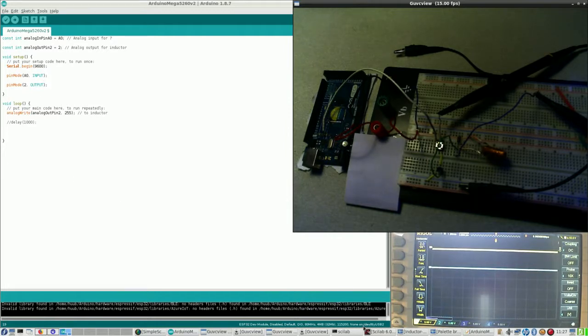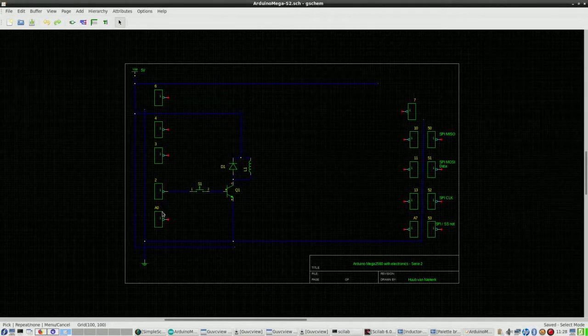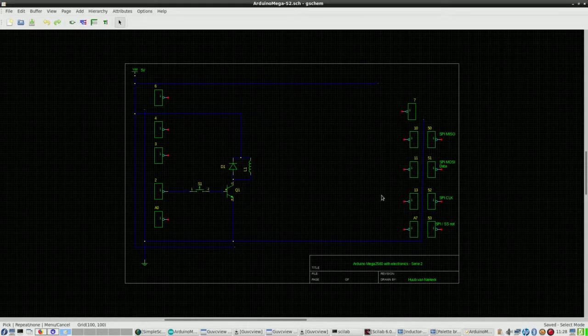Then, other thing. How are things going? Well, first of all, schematics. Easy to throw away all the schematics. Well, the old one still exists. I just started a new one, S2, Series 2. From port 2, which is pulse width modulation, that is the nature of the port, switch PNP, no, NPN, NPN is this, which it should be, and then a Q for, well, transistor. Why they use Q for it, I don't know. Connected to ground. Then inductor parallel with diode for EMF, for backlash.